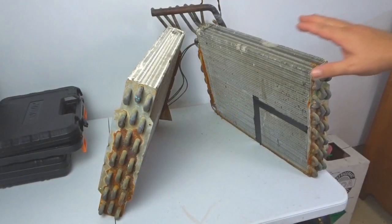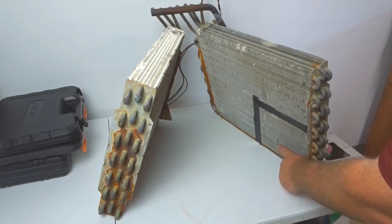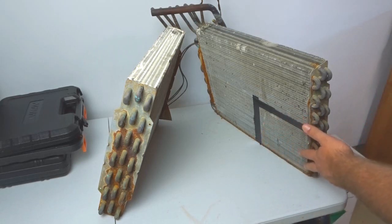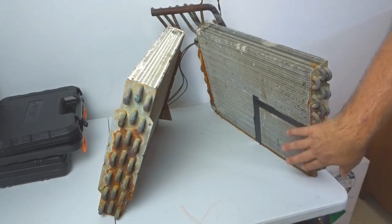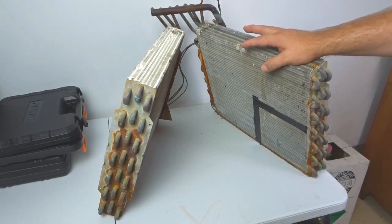This is the coil we'll be using. This is our search area, and this is the leak location as pinpointed before these tests began. We're going to pass through these areas twice. If the leak detector does not pick up the leak, it is a fail. If it does pick up the leak, it is a pass. It has to be a definitive ring off — you can't just blip a couple times real fast. It has to have a significant ring off, meaning it has to sound like something you would accept in the field, even though that is a little subjective.